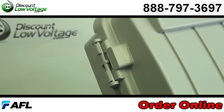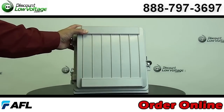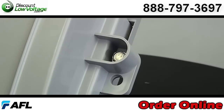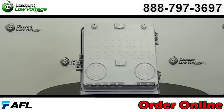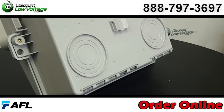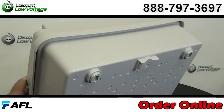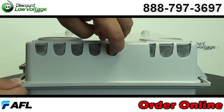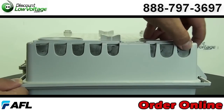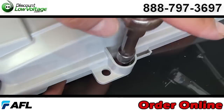This enclosure comes equipped with a splice tray and holds up to 24 single fusion splices. It can either be wall or pole mounted, with capacity for up to two adapter plates. It features a weather resistant plastic alloy, and a self-latching hinged cover design that allows easy access without loose parts. Self-sealing individual entrance ports prevent water and insects from entering the enclosure.